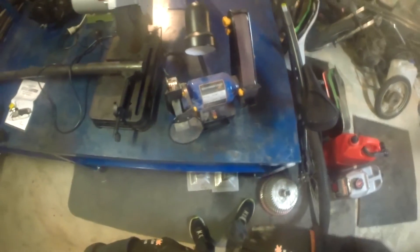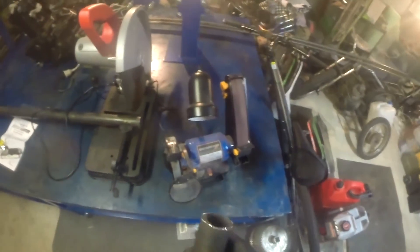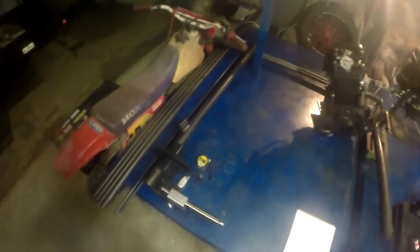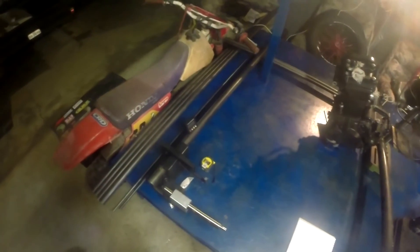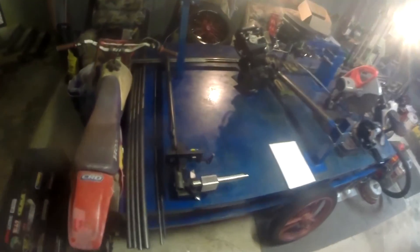To get that smooth, we might just put a nice round file in there and bring it all back. This will all be wiped down with acetone before we start welding, before we start doing anything too serious. It's now the 22nd of September — we already started this on Tuesday, it's now Thursday. We've got our notchmaster set up, one of the JD Squared ones. It's pretty good, can't wait to get to using it — it's going to be good fun. It's heavy as anything, so if you're breaking this, I think you're doing something wrong.